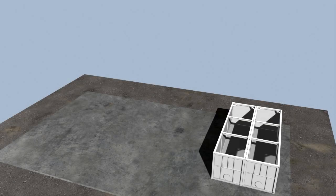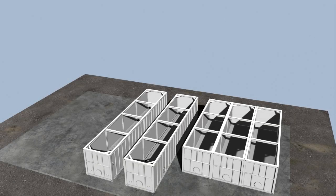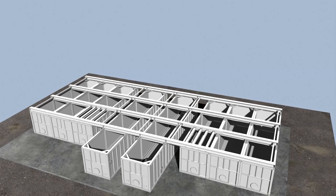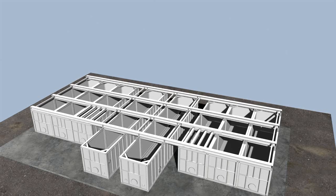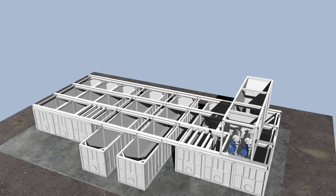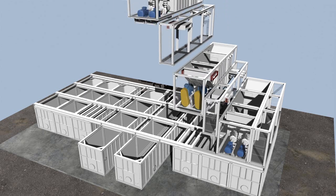The HSP2800 separation plant has a modular design. The modules are pre-assembled in containers, allowing for quick assembly. The first level of the containers is aligned on a prepared foundation. During operation, these containers are used as bentonite collectors. Cyclone feed pumps and screen underflow collectors are installed on level 2.